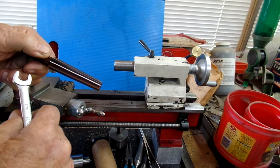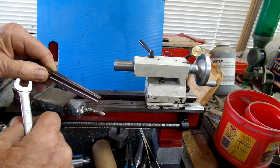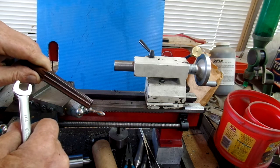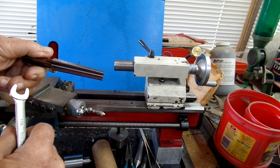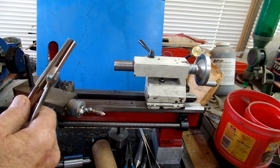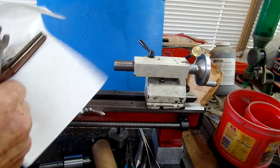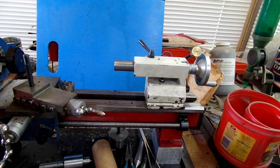You can examine what you get out of the number two Morse taper bore on the edges. I still get some little crap out of this one. The reamer isn't perfect, but for what I paid for it and the occasional use I do, it's great. I put it back in the rust-proof paper and hopefully it'll be there next time I need it. Anyways, there you go — it was my cure for a slipping Morse taper bore for my chuck.